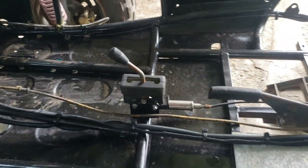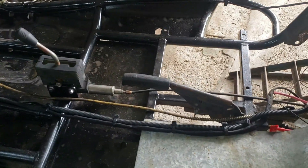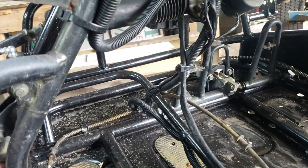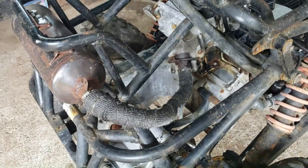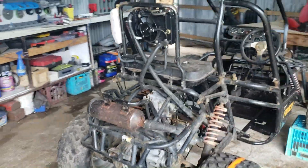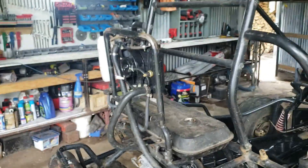So today I'm going to be cutting the welds off here, trying to remount this steering into the center, cut the tabs off. I'll be able to reuse this one for the gear stick — probably move it across over here somewhere around there. I've got to remove the handbrake; the cable on that isn't really good at the moment. I'm going to have to get rid of the bar up here so I can move the pedals and brake across and redirect some of these cables. The original exhaust wasn't any good so I rerouted some pipe and put heat protection on it. I'm not going to use the rear tray that was originally on it — I think I'm going to make up some sort of subframe to go around here, maybe from this point to there, and to protect the radiator as well.